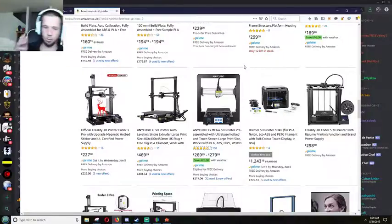And then I bought the heat block from China. But anyway, what this will do is it's 2 of these direct drive extruders butted right up next to each other that then goes down into a water cooled heat break. And then there's the heated block that merges both of those streams into one nozzle. So only one will push at a time, but it'll push, push, push, and then pull it back a little bit, and then let the other one start pushing, and it'll exit out of one nozzle.